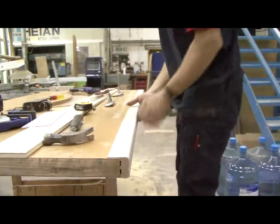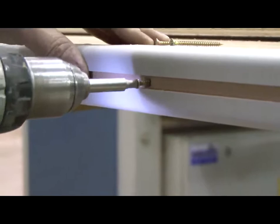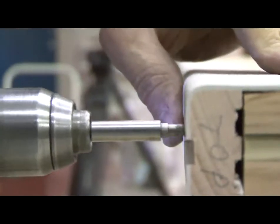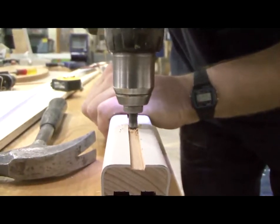Start at one end and fit the Armour Edge to the full length of the door. Once you are happy with the positioning, use the screws provided to secure the Armour Edge through the pre-drilled holes. You can drill additional holes on site if needed without affecting the fire rating.